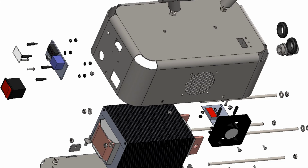Right round, four welds, and also they are welded here. But there's also a cap that needs to be placed in this hole. However, this is not easy. So what I've done is I've cut a tow bar off a car, and I have placed a bit of metal over it, and I have pushed the metal using a homemade press, pushing the metal over the tow bar to create a dome shaped bit of stainless.